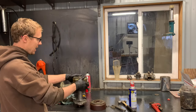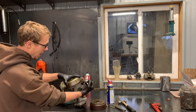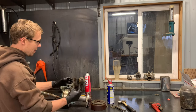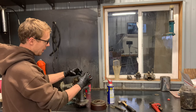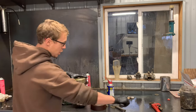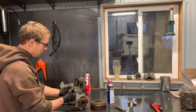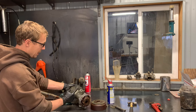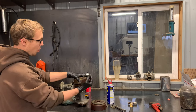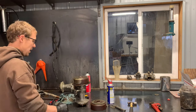When this carrier was sitting up, there are four holes in the top here. Everything is stuck together — even this pivot bolt here, this pivot arm that your cables pull on, was completely seized up. I couldn't get that to move at all. The difficult part is you don't know where to turn this lever so that these pads aren't putting pressure on this drum. You either tap it with a hammer in one direction or the other — you really have no idea. You can go off of this wear mark indicator here, but the problem is this lever is not situated where it needs to be. Either this arm wasn't put on correctly or the brake shoes are completely destroyed on the inside, and it seized up.